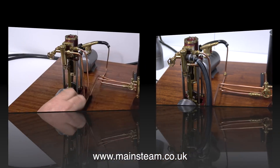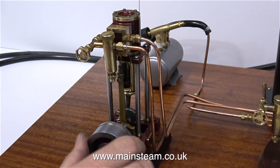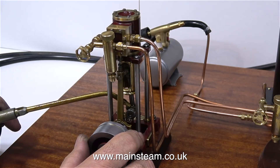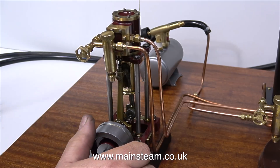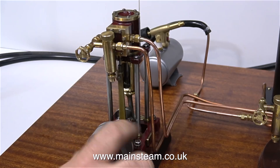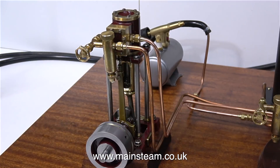I don't know why this has happened — I think the eccentric has slipped. This could have been caused by a variety of things. I think it's been caused because now the engine has compression and there's a lot more pressure staying in the steam chest, which puts more pressure on the valve, making it more difficult for the eccentric to move the valve up and down easily. So I think the eccentric sheave has slipped around the crankshaft slightly. You can clearly see that air has not been admitted until the piston is well on its way down the cylinder. What you need to aim for with a steam engine is early admission, and on an engine with a small flywheel like this, admission just on top dead centre is permissible, but certainly not after top dead centre.